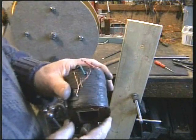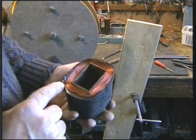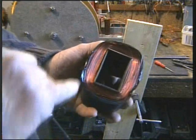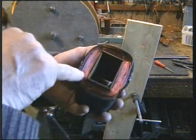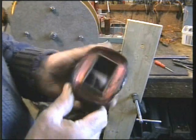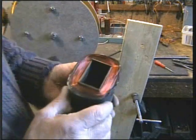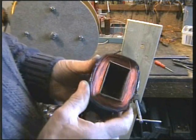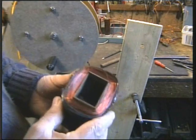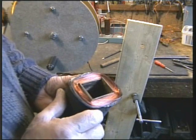I'm afraid it's not good news. The primary winding, which was in the middle - strange, but it was. The HT winding, as you can see, is in the centre of the core. I'm not going to bother with it - it's bad news. If I get close you can see dark patches all within the winding where the enamel has broken down, so we're effectively going short a turn. A bit sad for all the effort I've put into it, but I've got some copper on the reel. Well, we'll go with the microwave oven transformer. Incidentally, how much is a new ultrasonic cleaner, guys? I will not be beaten. I will not be beaten. But that's a shame.